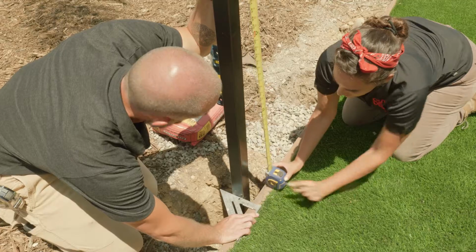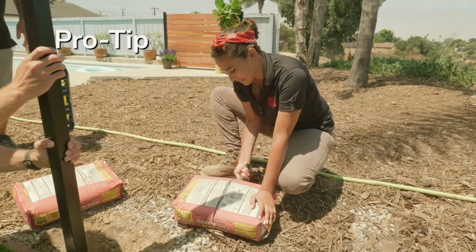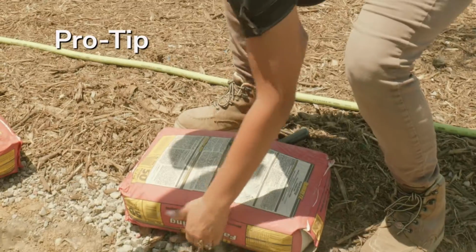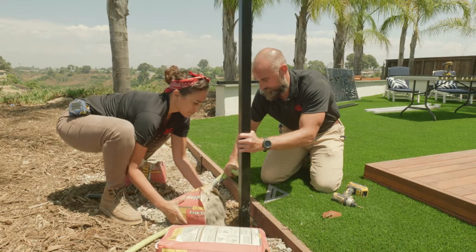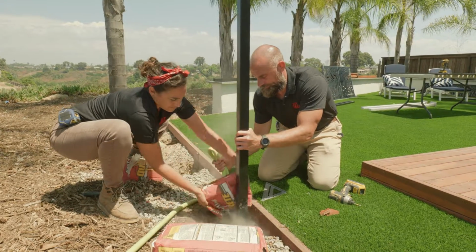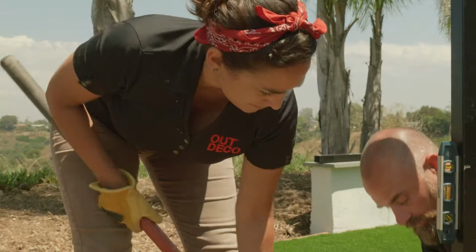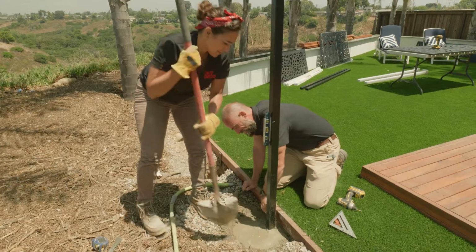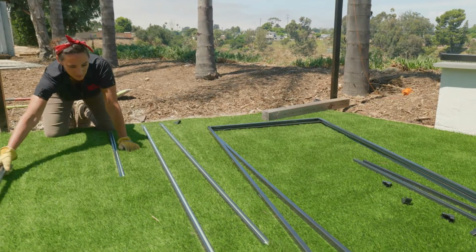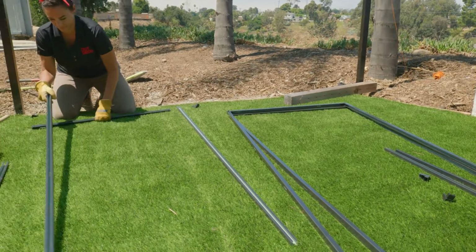level and plumb. If you are having trouble lifting your bag of concrete, you can just cut it in half like this. And now you have 2 half bags that you can pour in. And in this install method, we are placing 1 post at a time and using our panel to space out the second post. Now we're going to assemble our channel systems for our DESIGN-VU panels in a vertical installation.